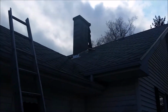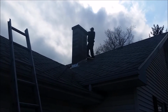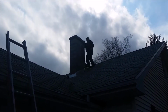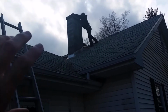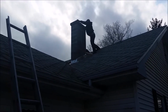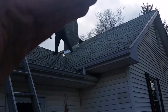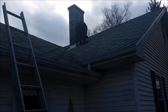So I was incorrect before when I was talking about roofing or cement caulking that he's using. He had me pick up the kind that you use for your eavestrough seams because it's waterproof, and he's using that at the top edge where his foam expansion joint is between the clay flue and the cinder block, and all around the edge where this flashing is meeting the concrete. He has that up there to block any water that might be coming tonight, and then the next job will be cutting a groove to make a slot for the flashing to go into, and then bend down, having them overlap each other to make sure that nothing penetrates that layer.